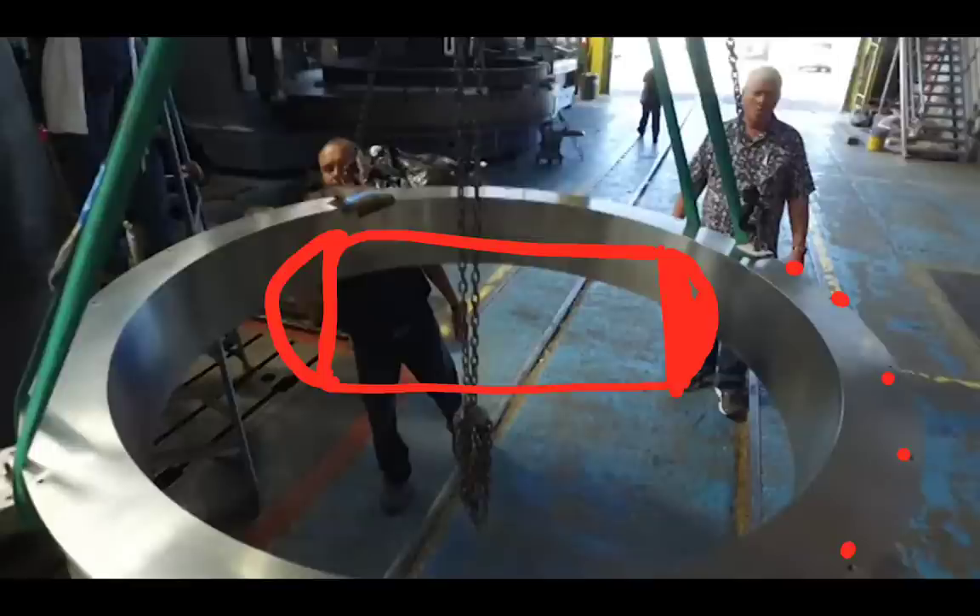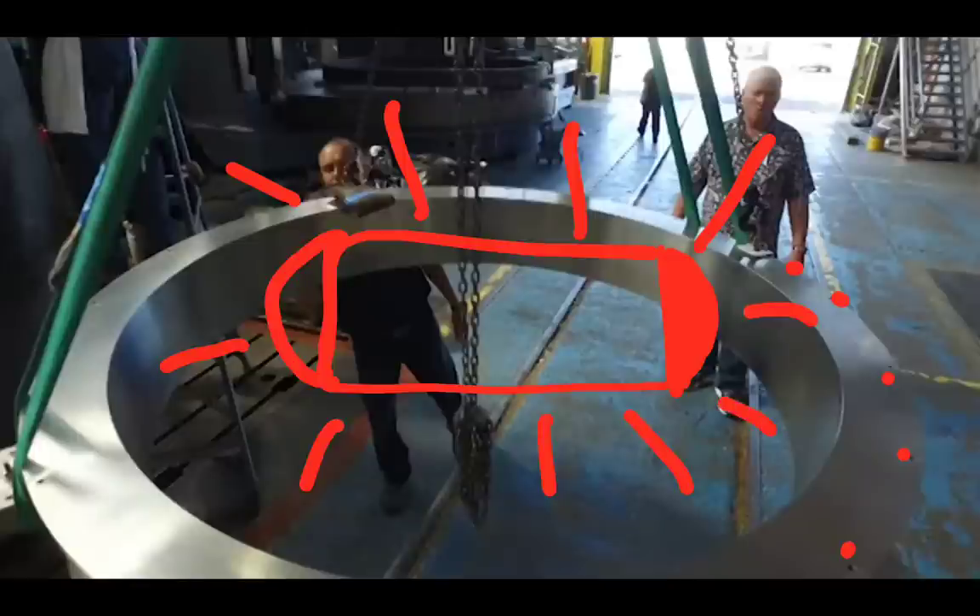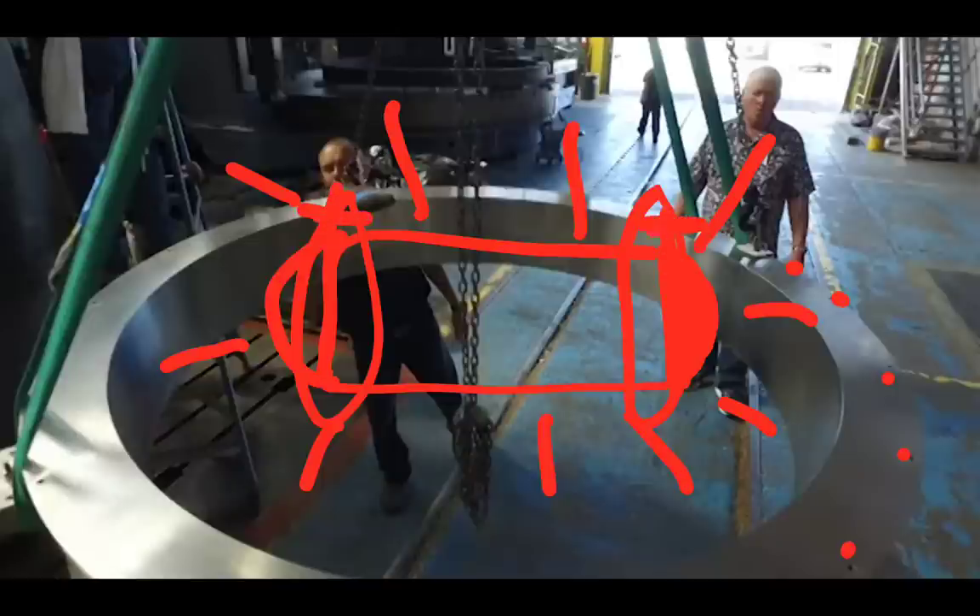It's glued, and you might say 'oh my gosh it's glued,' but realize the pressure is everywhere. Equal pressure helps keep the seal. The pressure outside in the water is greater than inside, so you just need the bolts temporarily to keep things in place while you're lowering it — so the door doesn't fall off until the outside pressure is what maintains it to the tube.